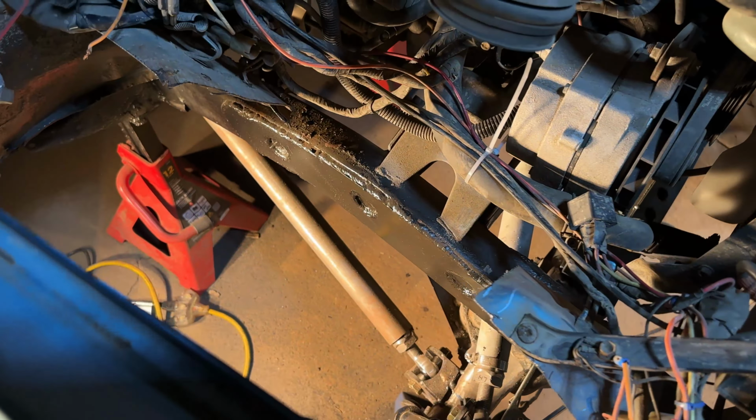mount 90 degrees? I mean, last time I was here, I was struggling thinking that the rod ends on these shocks weren't going to allow the amount of angle deflection when I have this thing fully drooped out. But then on my drive home, I was thinking, just turn them 90 degrees. Let the clevis mount or whatever it is in these shocks take up the forward and backwards and not side to side. Gotta get thinking sometimes.